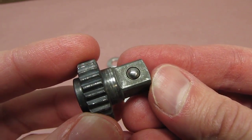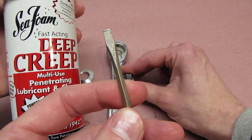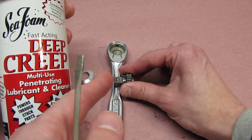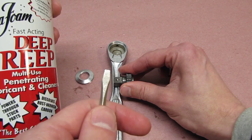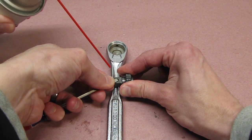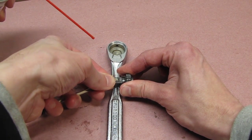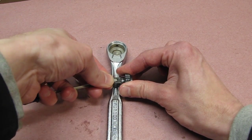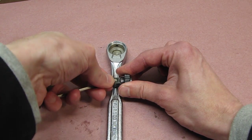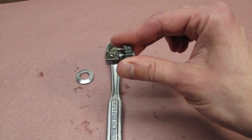Before we install this, I'd like to get some lube into this ball bearing. I'm going to use a small flat-bladed screwdriver to depress the ball and then spray some Deep Creep into the area to get it seated all the way in. I'm going up and down with the ball to get it to fall right in — that's pretty good. I'll wipe off the excess.